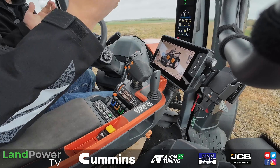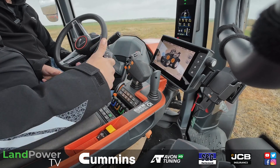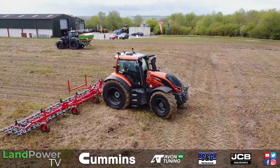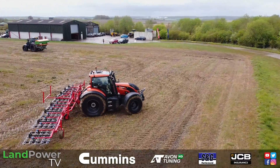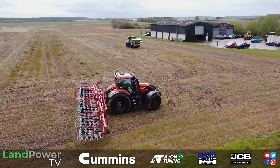We also have another package which is Auto U-Pilot. Ordinarily we can program our M1, M2, and M3 buttons to do a headland management sequence. But what this does is it takes that headland marker — say today we're going to have a 24-metre headland — as we cross into that headland, the tractor knows where it is and lifts the implement. If you have both Smart Turn and Auto U-Pilot, you sit there with your arms crossed reading the paper while the tractor does everything for you.